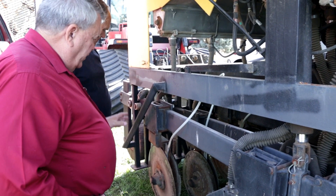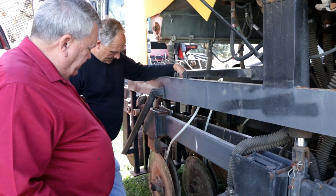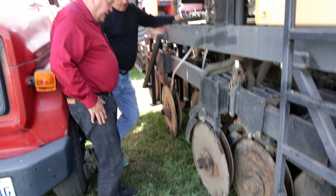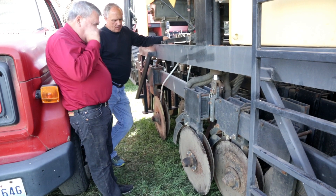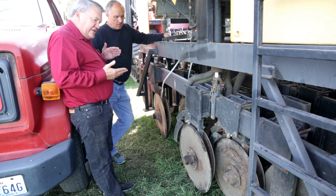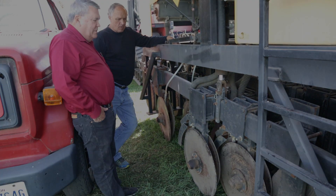Just enough starter for the first 30 days — you don't want to overdo the starter because then it develops shallow roots. You want to get most of the nutrient down deep. That blade is all polished up and running about four or five inches deep, while these seed openers are only going in about two inches at the most. One blade leads the other — that was Mort's original patent: make one blade lead so the seed would fall into that entrapment down there, and the blades had to rotate in order to release the seed — a very important part of raising top yields.